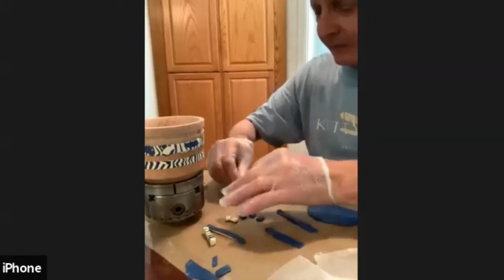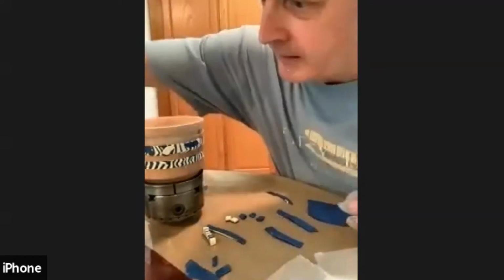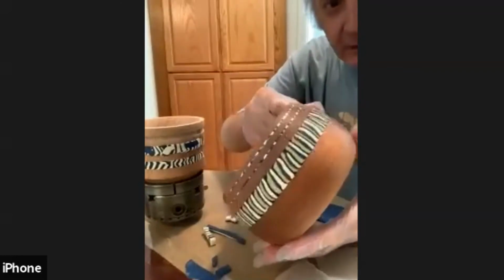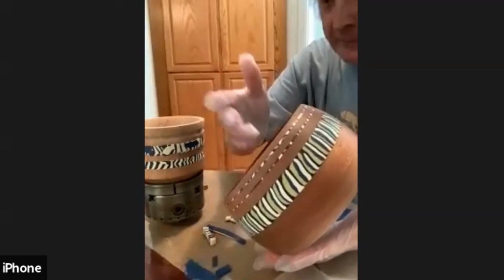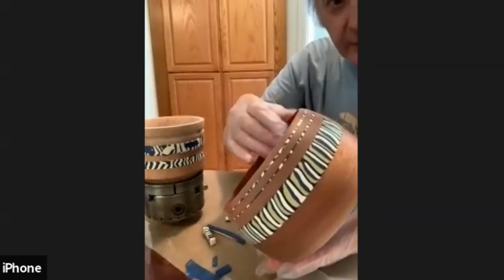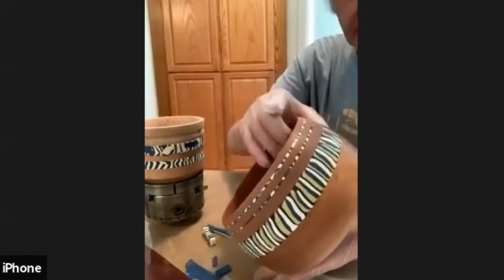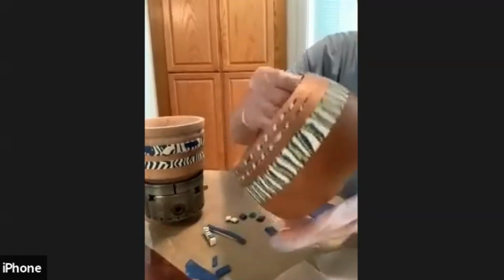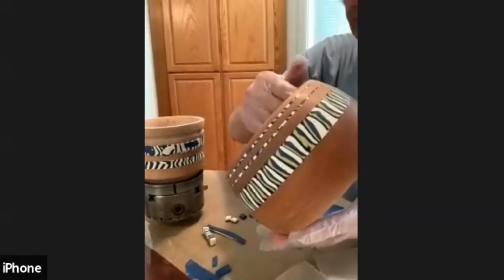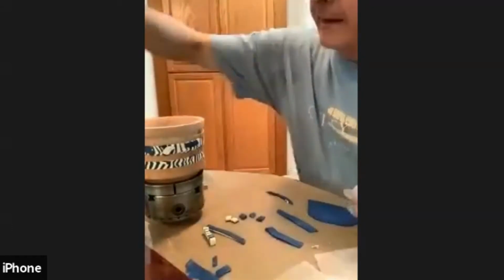I mean, I've always undercut my pieces, except for when I did small bands. Like, see, this one has two small bands on top. And that's just the thickness of, I think I used a parting tool to make those grooves. So these two aren't undercut. The big one is, and I've never had a problem because a couple of pieces have these little real thin bands. So, okay, that's interesting.